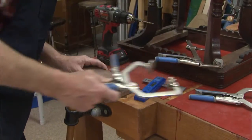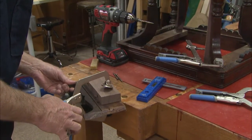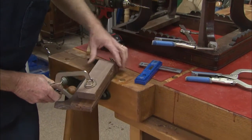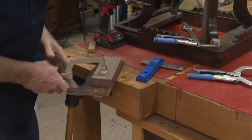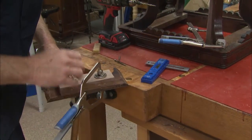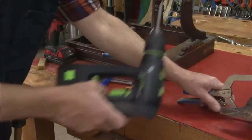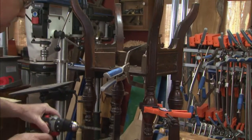And why do you let that do that? Because this next step in getting this support block on there, when you put a clamp on this and secure it flush to the bottom edge, what happens now is that block doesn't skate around. If you put that block on there when the glue is still viscous, it's going to be all over the place.